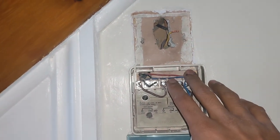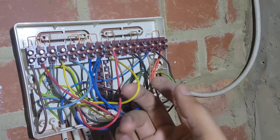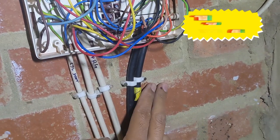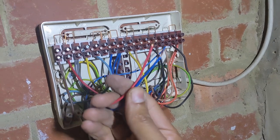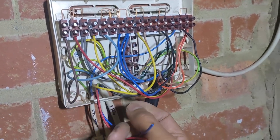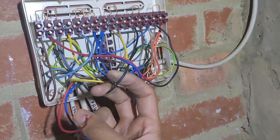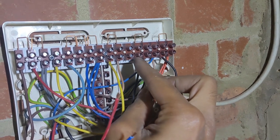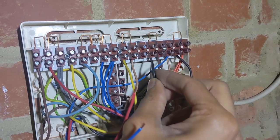We've got a call for heat coming from the wiring center and live and neutral coming from the wiring center. Because all these are going to be made redundant, we'll use these two cables to make life easier from the wiring center and from the Nest Heat Link - that will become our T1 and T2 once we fit the Nest thermostat on this wall. The yellow coming from the thermostat was our call for heat, linked to the brown here, linked to our hot water zone valve. These two were live and neutral on the programmer, so we'll use them as T1 and T2. We've identified these are going to be T1 and T2; this one here was our cylinder stat cable, our hot water on cable.